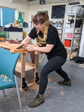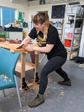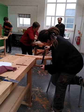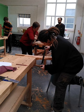Many of us had never used these tools before and it took a bit of time to find our feet with them. Certain techniques were useful to get the best from the tool — for example, whilst pulling the draw knife towards you it was easier to use an angle, and if you slid it from one side to the other you'd get a really satisfying wood curl.